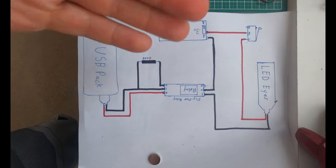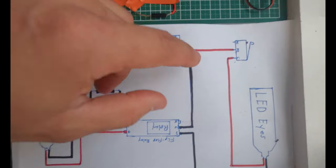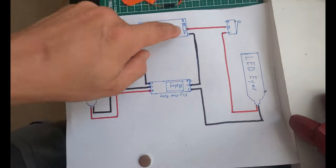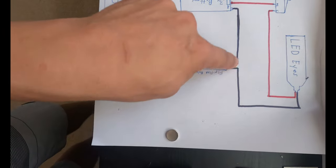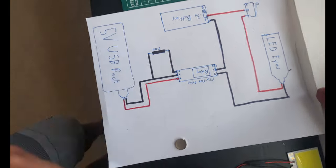There actually are no jumps or loops in this entire diagram. It's very straightforward and very simple to manage. Just make sure when you're doing the LED mask that you have the trigger hooked up properly. You can actually wire this all up first, and then you can add the flip-flop switch in by breaking this little circuit. And that's, again, all the flip-flop switch is doing, it's breaking this actual circuit right there.